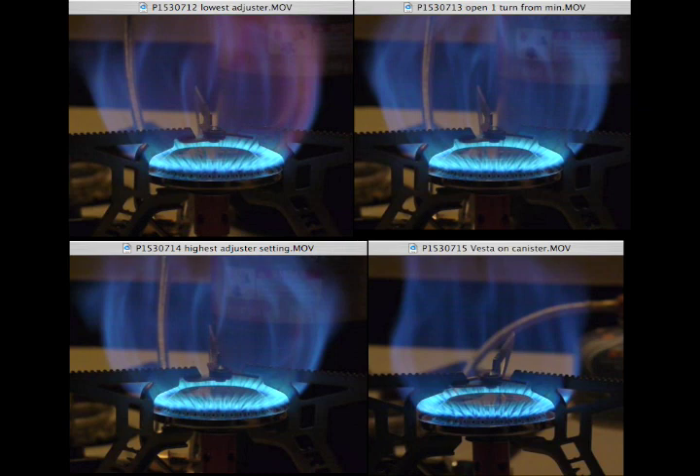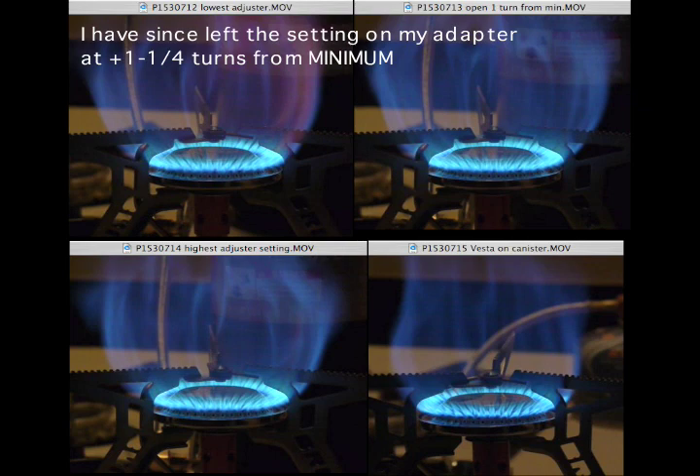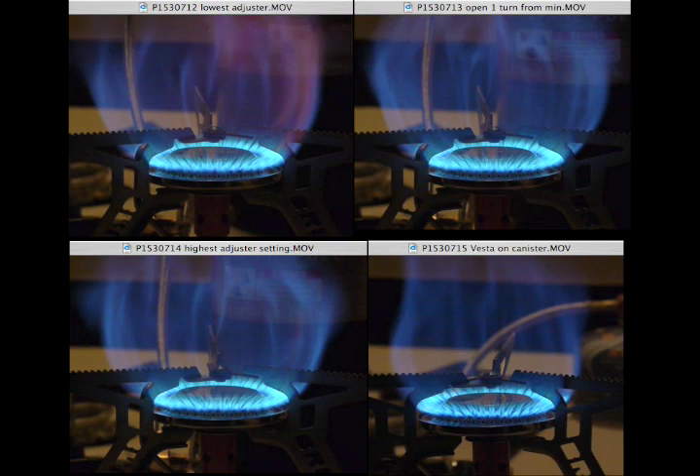This composite is pretty much self-explanatory. There does not seem to be much difference in the three propane flames demonstrated here — they seem to be pretty much the same. There may be a slight increase in flame height and overall fullness at higher settings, but it's relatively minor. This means most likely the maximum usable amount of gas going to the burner is present even at the lowest setting. The butane image, however, is definitely different — it shows that the output from the butane is somewhat less overall.